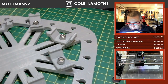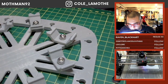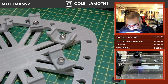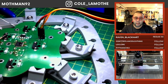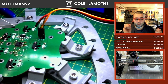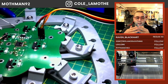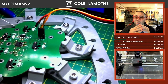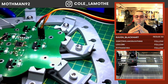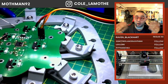3D model the thing with your material thickness, because especially if you're going to do boxes, you tend to use finger joints or bolt joints or anything like that where your material thickness makes a big difference. If you've got quarter-inch thick material and your fingers only overlap by an eighth of an inch, then obviously you're going to run into problems.